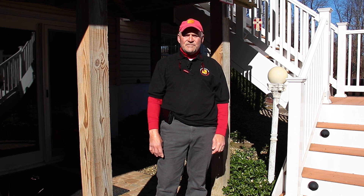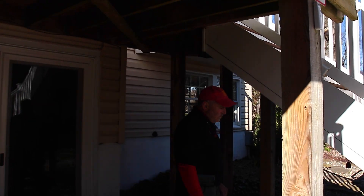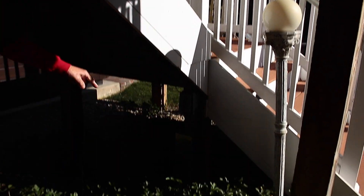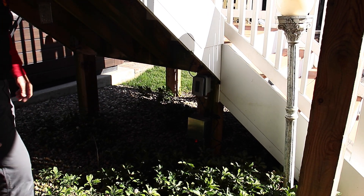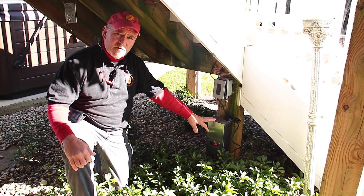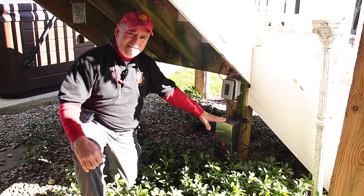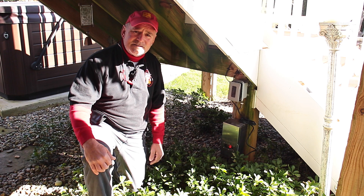There are many different shapes and sizes of lights so you can get pretty creative in your design. If you take a walk over with me you can see this silver box down below. That is what is currently called a transformer. The transformer takes 120 volt power in, converts it from 120 volts AC to 12 volts DC, and this is what powers most LED lighting systems today.